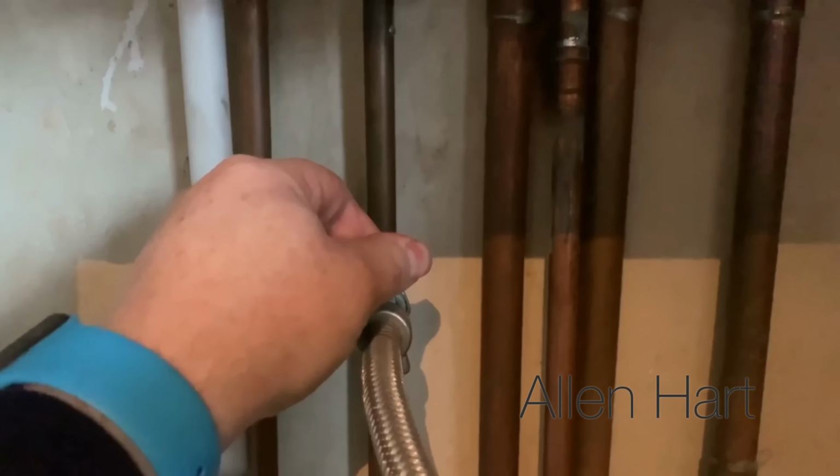and now we can just see pressure gauge going up on there. So I'm going to do it to about 1.2, and then I'll turn it back off. And then we'll see there, the boiler will now work again now. And that's how to top up or refill your Sime boiler.